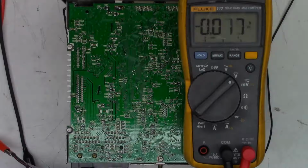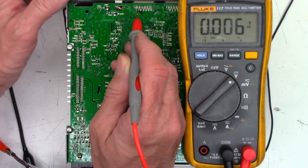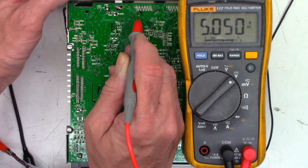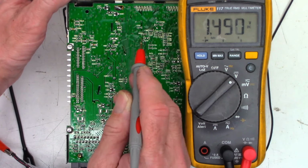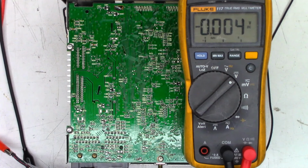Well, one moment. Okay, still not working. Power on. The CD should go through its little self-test. And I think it's done. So looking at, I believe it was the second pin over here. There it is. I've got 5 volts until I press the button, then it goes to 0. So I know that that is actually functioning correctly. So getting 5 volts over to here, switching as I press the power button, and we're not getting any reaction from the main microprocessor, as far as I can tell. I don't know where to go from here.